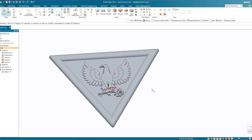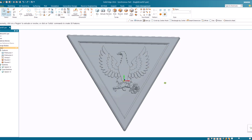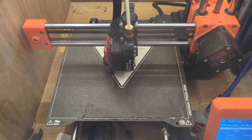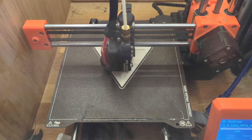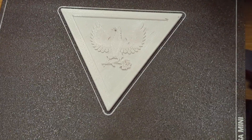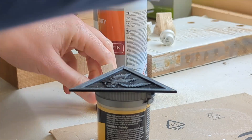I'll start off with the Ruin Family Crest, which is a cape pin. This is a relatively simple make — 3D print it, paint it, and it's finished. The book describes it as a golden eagle holding a rose on a white background. I drew the eagle and the rose in Inkscape and then brought the curves into Solid Edge. I extruded the different segments to different heights and then exported it for 3D printing. Because I'm FDM printing here, a lot of the detail from the sketch is actually lost, but some of it's retained and you can at least clearly see what it is.